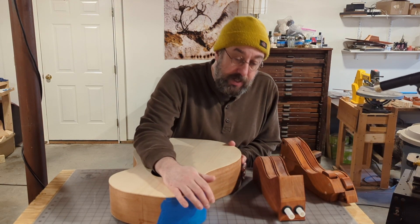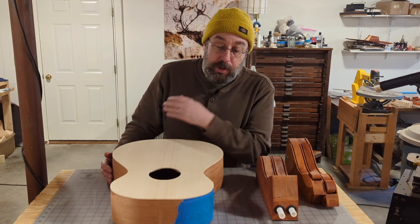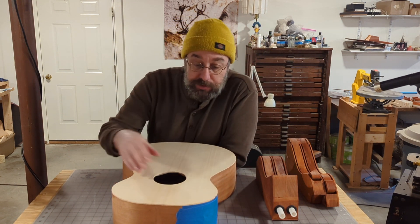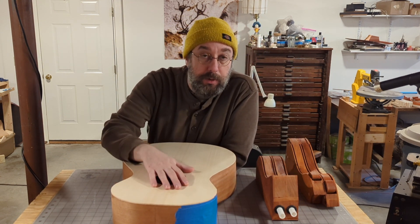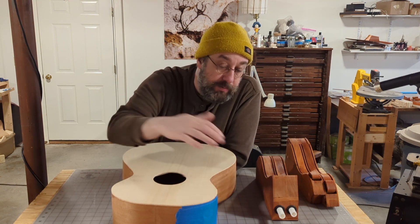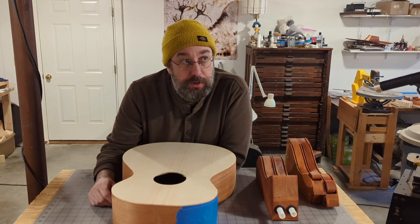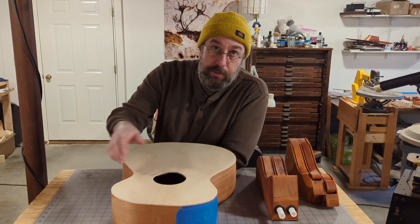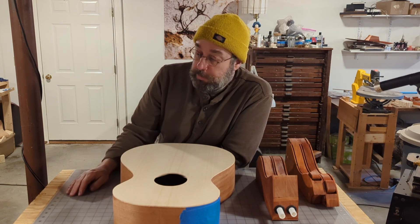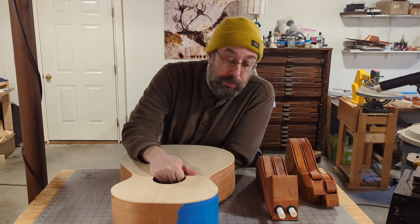So with the side taped off and air blocked, we ended up with very similar results. Now we can't have tape on the finished guitar, so we want to get the same kind of 95-hertz range body resonance. What we'll have to do is make the sound hole slightly smaller, and we know that for each one-millimeter reduction we'll get a drop in frequency of around 0.65 to one hertz in that range. We'll try to target it. What we'll actually do is make it smaller than we need it and then slowly open it up until it matches where we want it to be.